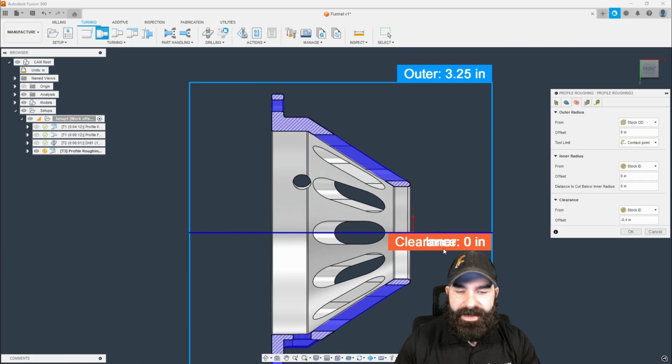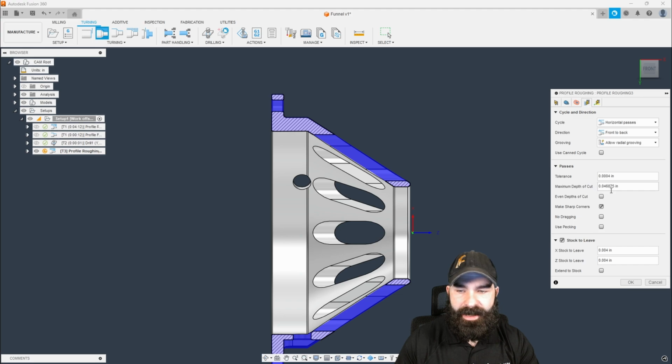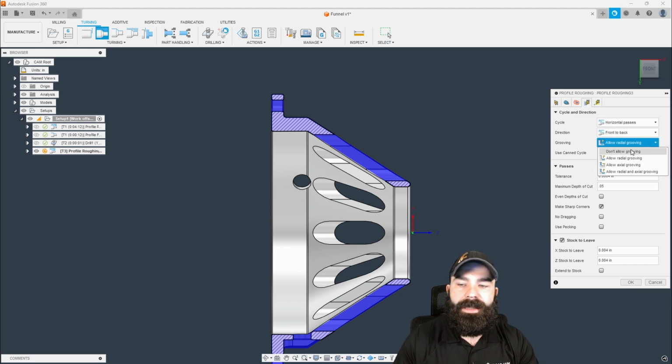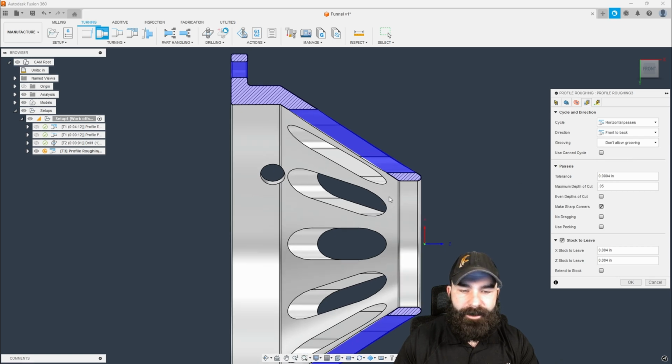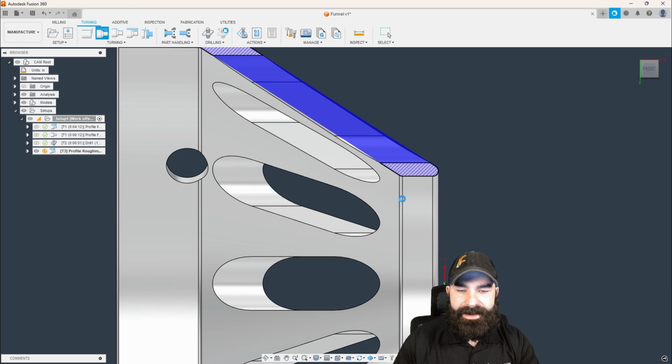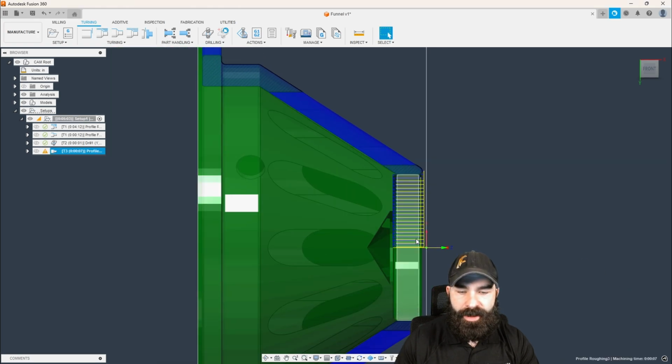Our radii, if you guys haven't caught my other videos, this is where a lot of people have some troubles with your boring cycle. We're going to go ahead and leave this for now, but we're going to come back and fix it once we see the error that we're going to see. Again, I can adjust my step down. I'm not going to allow any grooving because I don't want to wrap around this fillet in here. So let's go ahead and get our toolpath and then go back and make our corrections.